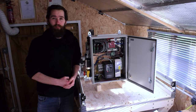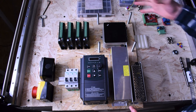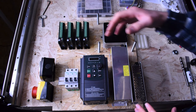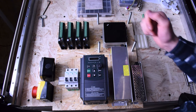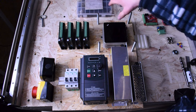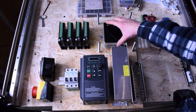So I'll stop rambling on and we'll dive straight into the video. Right, so we're back here at the CNC and the goal today is to get the electronics installed and all wired up. I pretty much decided this is how I'm going to lay everything out. You can see I've made a few changes here. I've got my three fuses — a 10 amp and two separate 3 amp fuses. The 10 amp will power the spindle. One of the 3 amps will power the control electronics including the two power supplies, the NEMA drivers, and these sorts of boards.